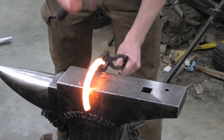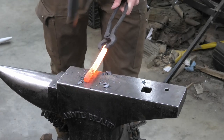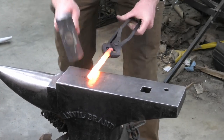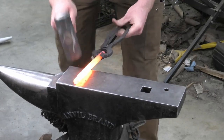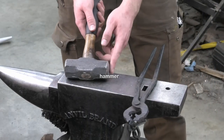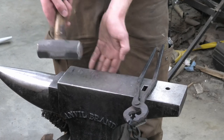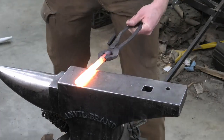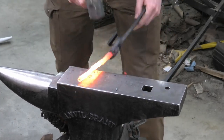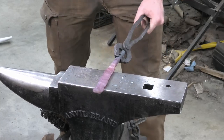First I just need to straighten this. Now I can start trying to get it globally flat. When flattening this out, I'm going to do everything I can to increase the PSI, because that will speed this up a lot. That's a huge part of blacksmithing — doing everything you can so you don't have to do as much work. I'll use the rounded side of the anvil to increase PSI by making more of a point, not a completely flat face, and also working on the close edge of the anvil. It's going to get super wonky and wavy right now, but that's easy to fix afterwards.